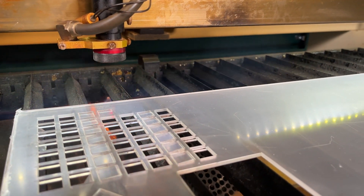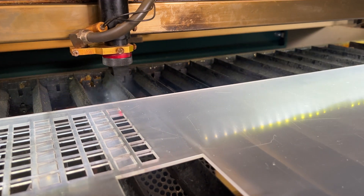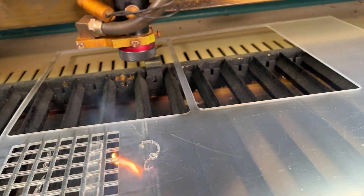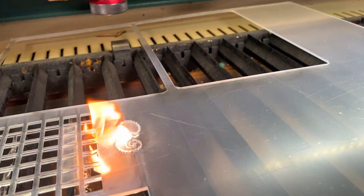The first variable I looked at was the cutting speed. I set the 63.5mm lens as my standard, and switching to the 101.6mm lens, I didn't notice a significant speed shift. However, when I used the 127mm lens, there was a noticeable drop in speed, especially with the acrylic. I assume this is mostly due to a poorly configured air assist, with the beam having to travel through much more smoke before reaching the material.